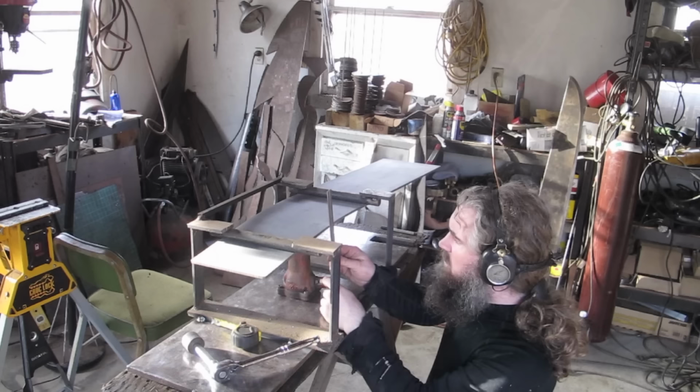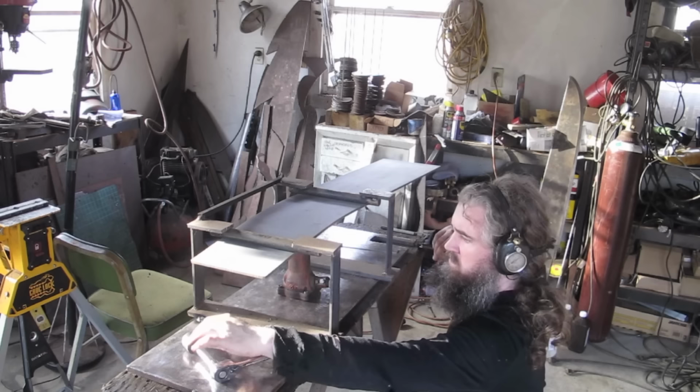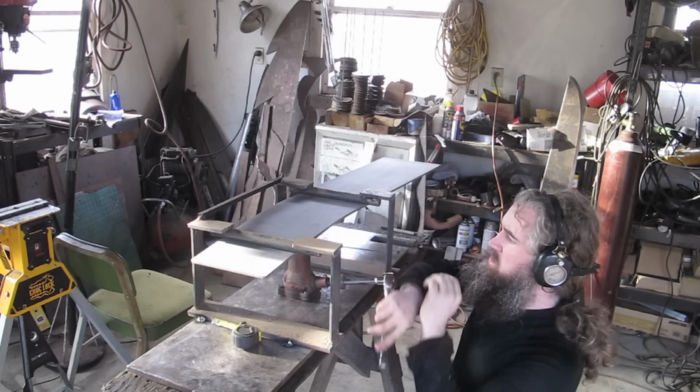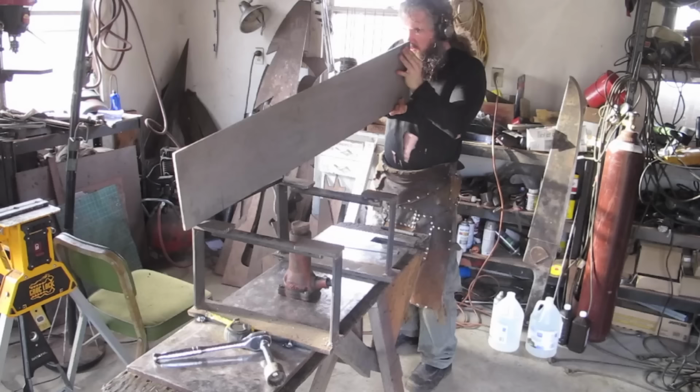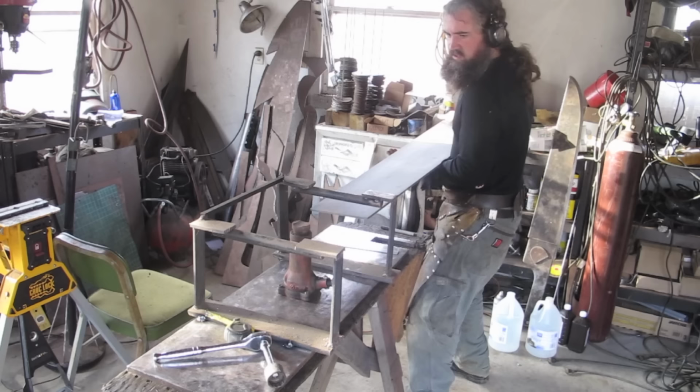Three marked points, 10 millimeters of deflection at each point. This warp I'm trying to take out is really small, but that's the problem when you're trying to take out a very small imperfection: not going too far and ruining everything. It's still there. More than 10 millimeters of deflection at each point, it would appear. I'll try 20, I guess.